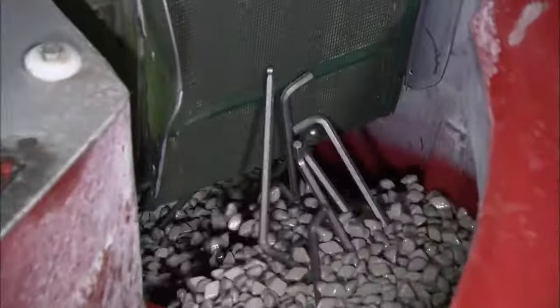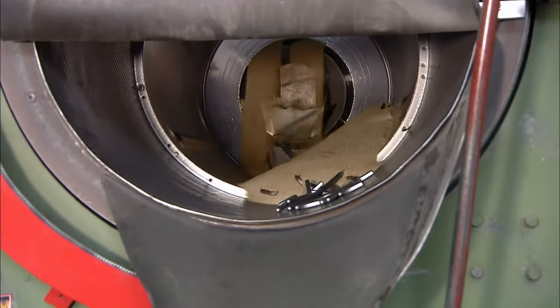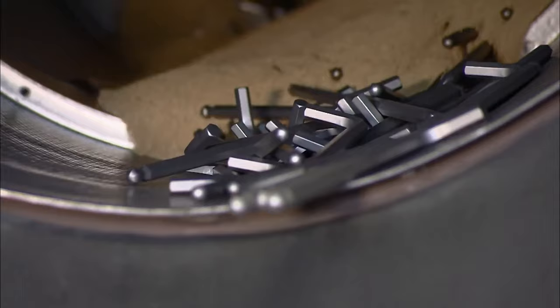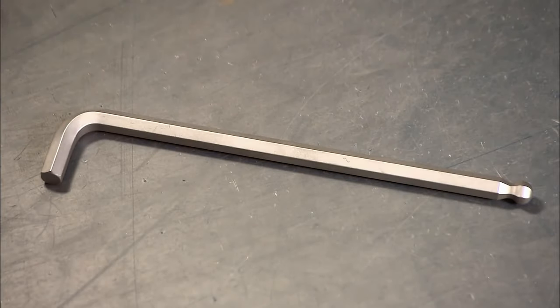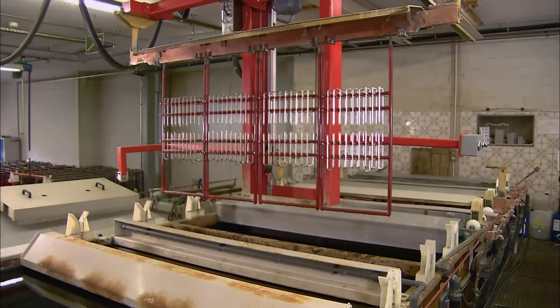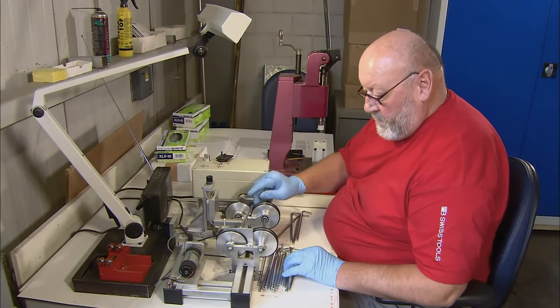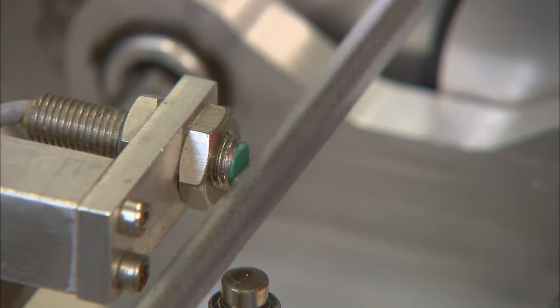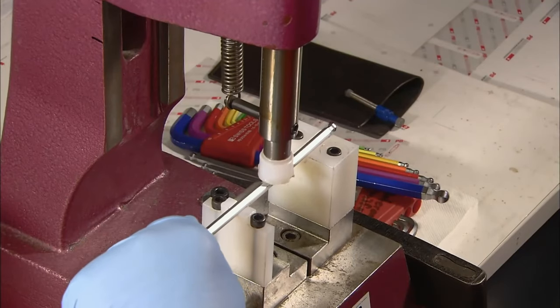A mechanized tool then bends the steel at this softened point to give it an L-shape — the hex key L-wrenches are beginning to take shape. The next step is to heat treat the wrenches to make the steel even harder. The parts are first fired in a furnace before being quenched in oil, then heated in a second furnace at a slightly lower temperature. The heat treatment strengthens the steel but leaves a residue. A wash followed by sandblasting cleans them up, but doesn't remove the tarnished look, so the pieces are placed in a vibrating machine with ceramic stones and polishing solution to clean and brighten the steel. A magnetic conveyor extracts the wrenches and transfers them to a revolving drum where they bounce around with grains of corn to absorb any residual moisture.